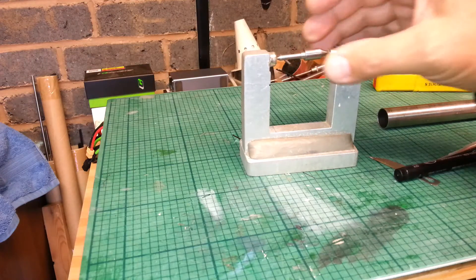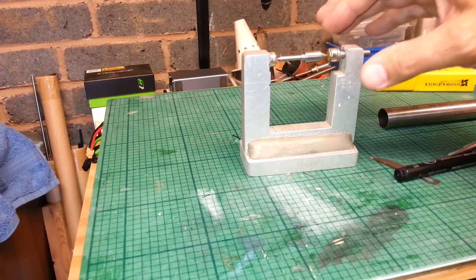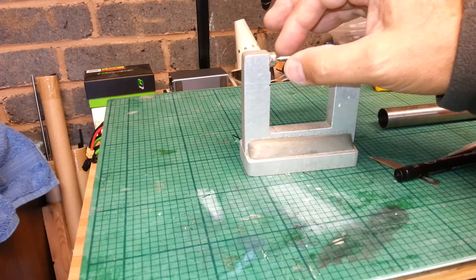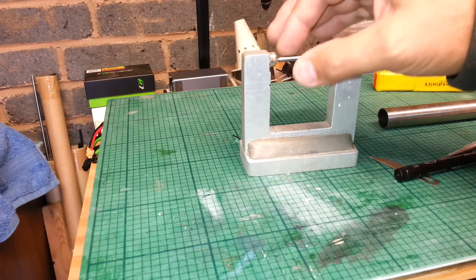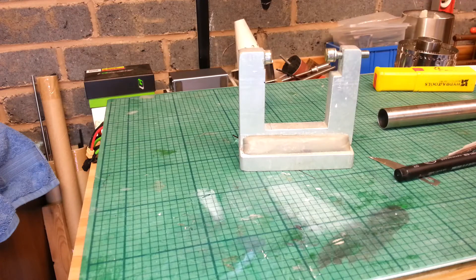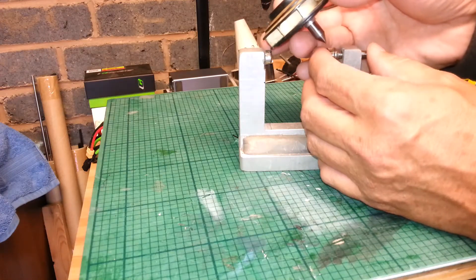This is a shaft that's made to fit the compressor wheel. It's got to be something like 3.7 at this end to clear through the spinner on the wooden compressor wheel. So I'll just push it on my wheel and give it a look. That's a bit tight — it could do with emering down a bit more. It's a bit tight on the diameter but we're just going to give it a look anyway.